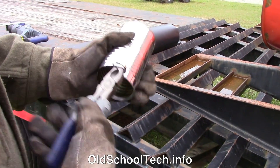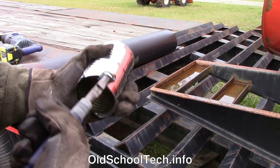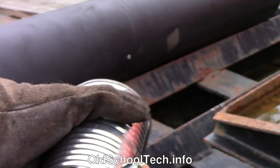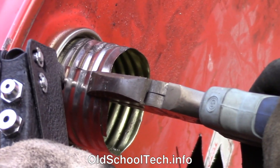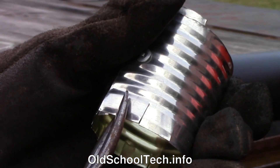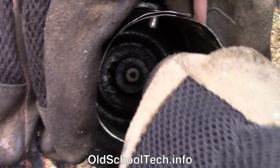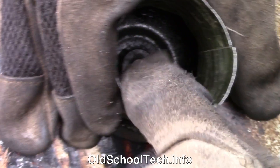We also need to join the blower to the large barrel plug hole. Fortunately, both the plug hole and the hole in the back of the blower are the same size. To join them temporarily, we cut a soup can down to recover the material. Here we are using the barrel hole as a guide to rivet the can together. Next, we cut some tabs in the can, then bend them inside the blower. Now we can use this to temporarily join the blower to the barrel.